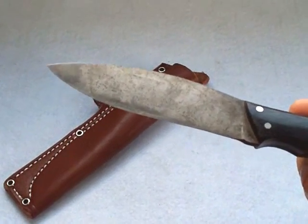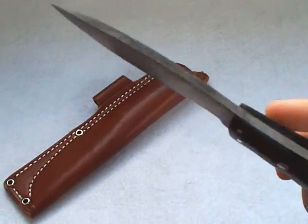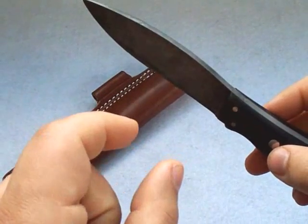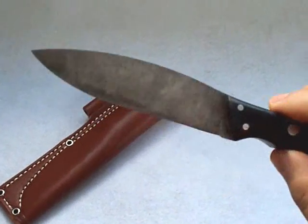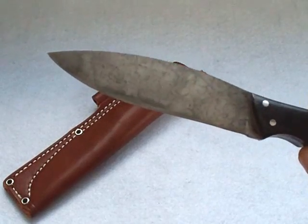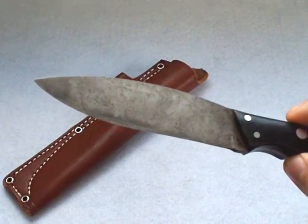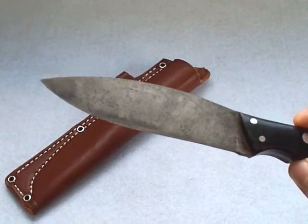You can do different patterns if you want. I simply just wrapped this in the rag. What I see a lot of guys do is the Strider tiger striping — you can do that by folding paper towels into thin strips and placing them across the blade in strips, which would give you a tiger striping pattern. The longer you keep your acids on the blade, the deeper the color will be. I did a full hour and got this medium gray. If you kept it on for two or three hours, it would be a very deep gray, almost black. You may prefer that.